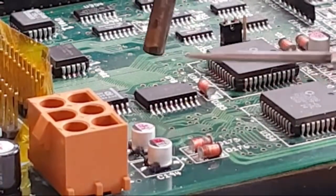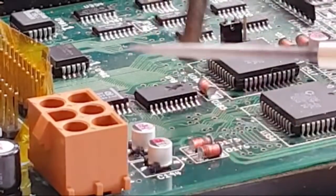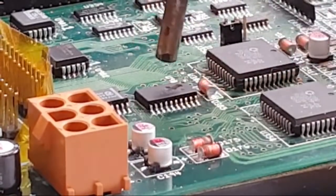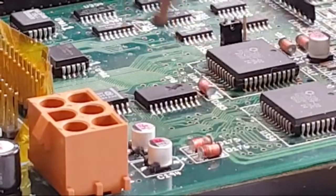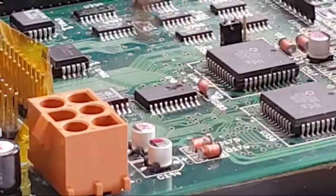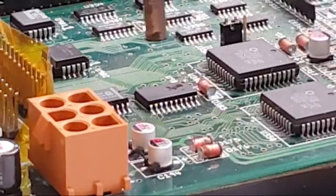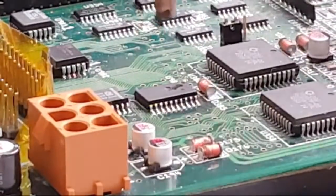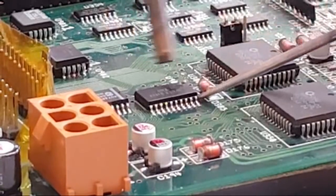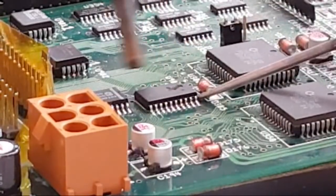And I think that the thing that was confusing it is this one. I think whilst it's primarily the Terminators deal with bits D0 and D1, I actually think the other bits are relevant. And I think that this chip here is pulling them the opposite way they need to be in order to trick it by just pulling D0 and D1 to ground. Does that make sense? I'm not sure I'm making any sense with some of the stuff I'm explaining, but I think after this, a Terminator would work on this, actually. Even just soldering resistors underneath like I did previously, I think, would trick it into realizing there's no drive. I mean, we're not really tricking it, are we? We're just telling it there's no drive, because there is no drive. That's the whole idea of that Terminator.